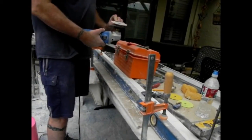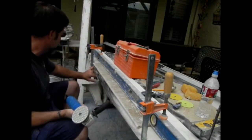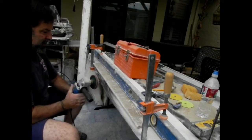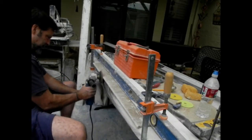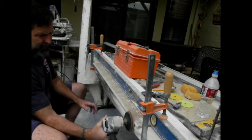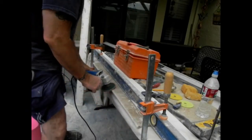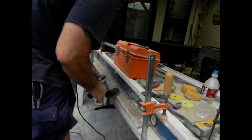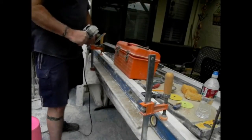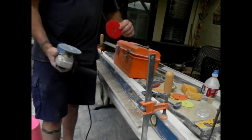On to 200 grit. The reason I like to get down here is because you're going to see this edge and I like to make sure it's perfect. I polish this edge and make it nice and straight because it's like a finished edge — once you put them up somewhere you look down at them. I'm going back and forth like a seesaw. You go through the pads: 50, 100, 200, and then 400 — there is no 300 pad. Last but not least, 400 grit.